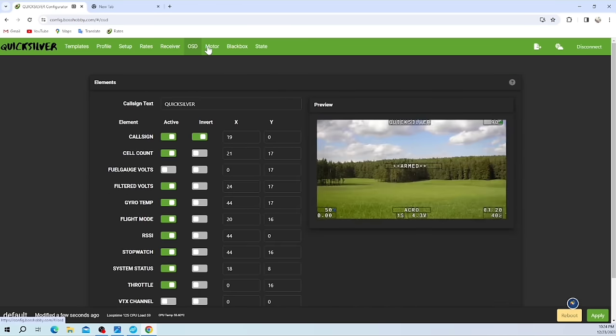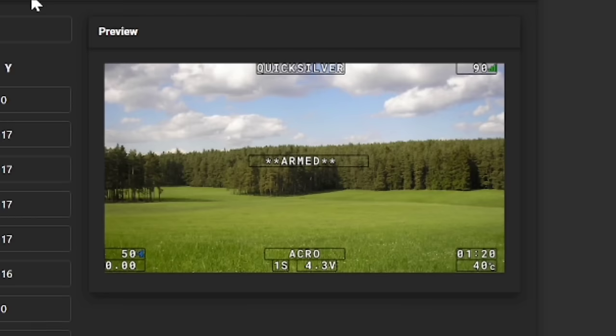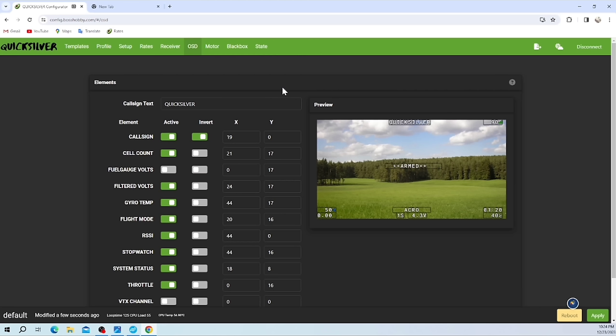Then you can come to OSD. I'm not an OSD nut, so I don't really care that much about it. Just give me my voltage. I do appreciate a pretty and interactive OSD. You can change all the settings. You can tune the quad. You can do all that from the OSD by using the stick commands. I'll have any kind of notes that I needed to add to this in the description of this video. Here is the OSD, and that's good enough for me. Gives me my LQ, gives me all that stuff. One thing I will say, if you're using the Vista, the OSD doesn't come on until you arm the quad.